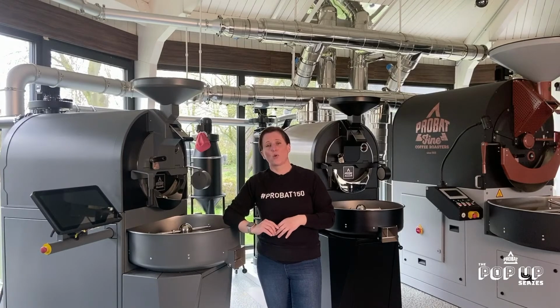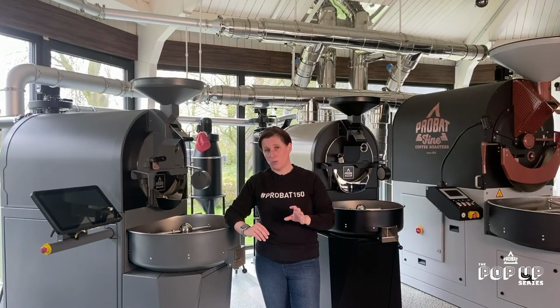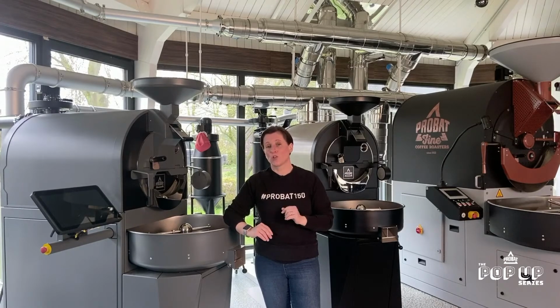Also here, very important, while you set up your machine and heat up your roaster, make sure that you also watch your outside weather conditions, because if you have slight differences here and you probably come from rain and go through the day to blue sky and sunshine, this slightly changes the conditions in your machine and also the condition of the air suction, which is now pretty cool to monitor with the negative pressure which is shown on your display, if you, of course, bought this option. This helps you to be very stable all the time during roasting on your roasting day.